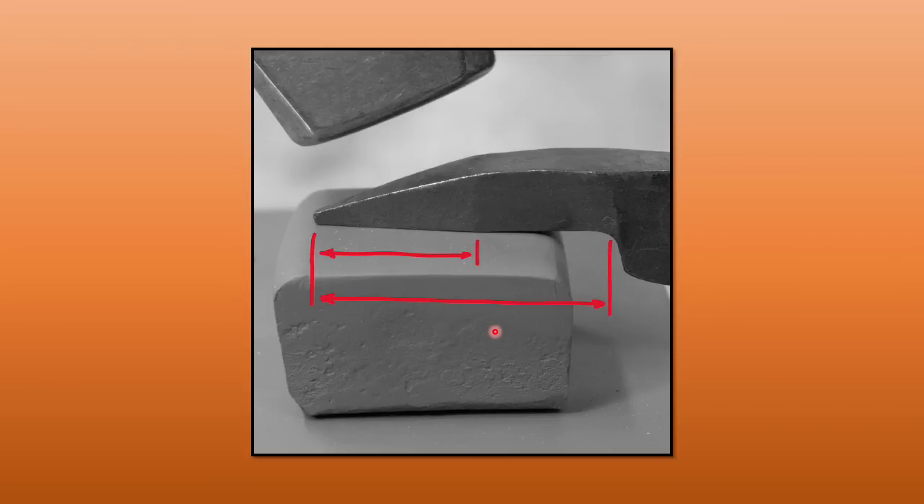At this stage, because you're going to have to make two of these, I want you to record two lengths: the length of the taper and the length of the overall jaw. I typically do a couple of chalk marks. When making the other side I can hold it up for comparison and make sure everything is equal to the first jaw — remember, we're making two identical pieces.